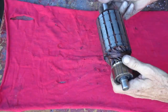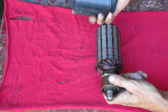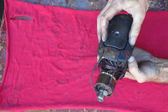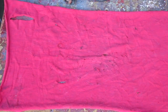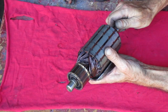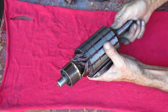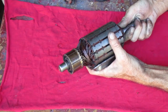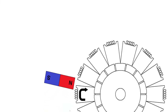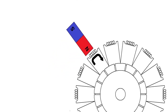On the armature, remember how these wires wrapped around in this oval shape? Look how this magnet is about the right size and shape to fit around this coil area. So now you can imagine this armature turning next to the magnet, and each individual coil in the armature is moving into and out of the magnetic field — so each coil is seeing magnetism, then no magnetism, then magnetism again, then no magnetism — on and off multiple times per second as the armature is spinning under the magnet. Each time that magnetic field goes across those coils, an electrical charge is generated.